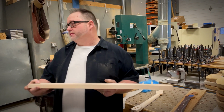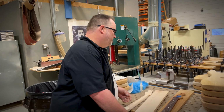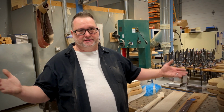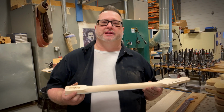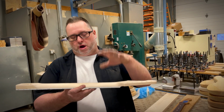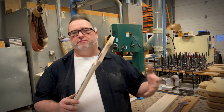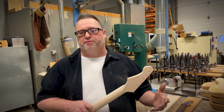in a large specialty oven that is designed for roasting woods. We actually had to make our own because there's not a company that actually does this. But the process is essentially an extra step of drying your tone woods or your hardwoods. Air drying will get the water that's not trapped within the cell walls out of the wood. And that's what a lot of people will do. It takes a long time and it's a very slow, tedious process.